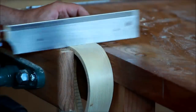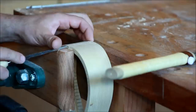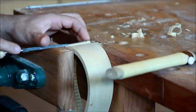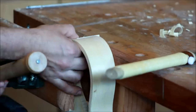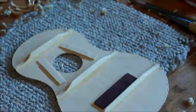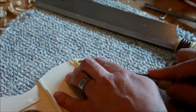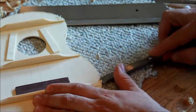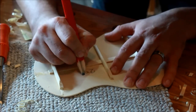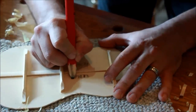Before I put the soundboard or backboard on, I want to put a wedge piece at the joint at the back where the two sides meet. I'm using a little wedge I made from 2x4 and cleaning up the opening for the glue-up. I'll also use a piece that has a little knot in it — I think that's appropriate for the 2x4 construction since 2x4s do have a lot of knots. I also thought it would be a nice touch to use a carpenter's pencil to write '2x4 uke' inside, which is going to be visible through the sound hole.